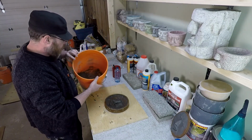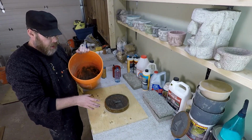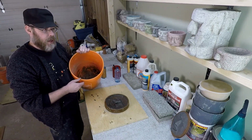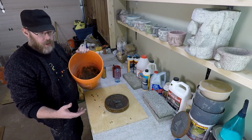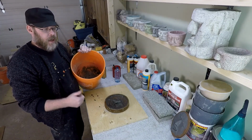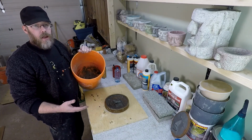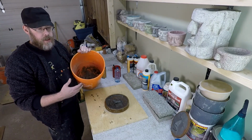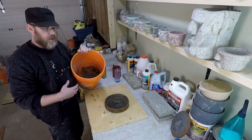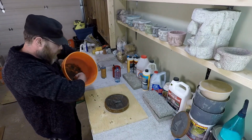But what I've just done there by painting that in, it is going to give it a more intense coloration, but it's also going to help me pick up a lot of those fine details, and it's going to help limit honeycombing of the concrete. I could also eliminate the honeycombing by using water reducer or super plasticizer in my mix, which gives me a thin placement viscosity without the dramatic strength loss that you would normally get from overwatering. It's just like overwatered concrete, but you're chemically doing it with a super plasticizer so that it doesn't compromise the strength when it cures. Let's go ahead. I'm going to put this in quickly here.